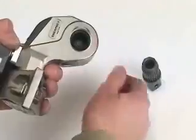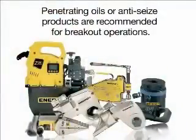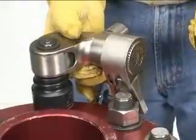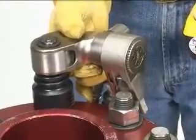Loosening. Fit the drive shaft to the opposite side of the tool. You may first want to apply releasing oil to the threads and allow the oil to penetrate. Position the wrench socket on the nut as shown. Operate the pump and S-Wrench until the nut is loose. When loosening bolts, a torque value higher than the tightening torque is normally required.